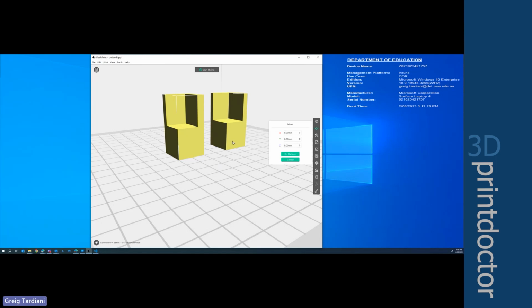Keep your height low when possible when you're laying out your prints, because it will print quicker than a tall vertical object. Also, you will find that you've got shear planes across here, and it could crack on you at some point in time if you put a load in a shear plane. So sometimes you've got to orientate for strength as well. There's a whole pile of things that you need to look at. So it's complicated, but it's not. And if you're just prototyping, it's just a way of doing it.